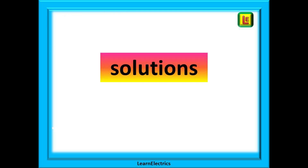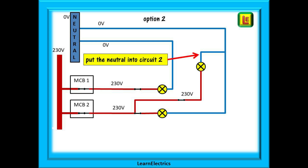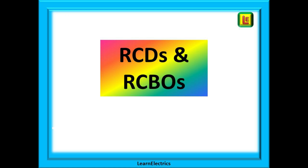There are several solutions. By far the safest method is to move the live feed for the stair light onto circuit one. This may mean taking the live feed from upstairs and running a new switch wire to the switch at the bottom of the stairs — potentially involving some chasing out and redecorating, but what is that compared to the dangers of an electric shock? Another solution is to take the neutral to circuit two. This may mean disruption such as lifting floorboards to access the lounge ceiling roses or refitting bedroom carpets. Every situation is different, but you do have a duty of care to inform your customer of any dangerous situations.